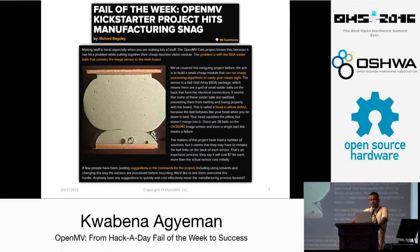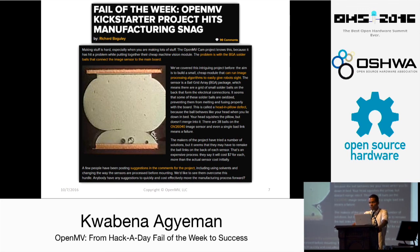When we built our prototypes by hand, we didn't have this problem because we could use as much heat as we wanted — we just kept applying the hot air gun until it worked. But in mass production, you have a reflow oven flowing boards through, and you can only really put them through once. Doing things by hand is very different from mass production. That's how we made Hackaday's fail of the week.